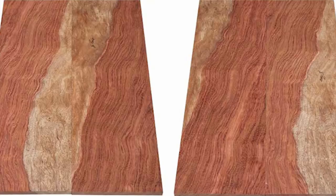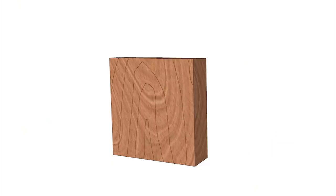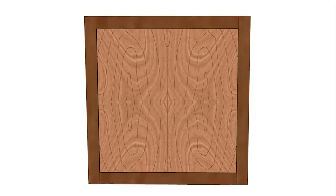Maybe material savings isn't a big factor with common white oak, but what about highly figured wood? You might make your valuable wood go twice as far or even further if you use frame and panel construction. Some highly figured materials may only be had in small pieces — you may only have one square foot of crotch grain and you need a panel that's four square feet. Well, you could saw that into thinner pieces, bookmatch it together, and now your one square foot of wood has become a four square foot panel, which is not only made stronger if you put it inside a frame, but it is also more attractive.